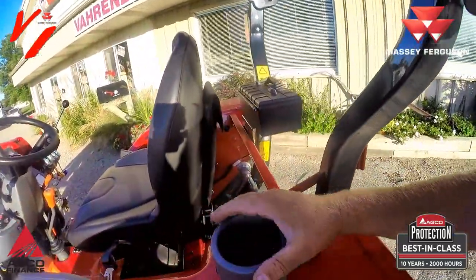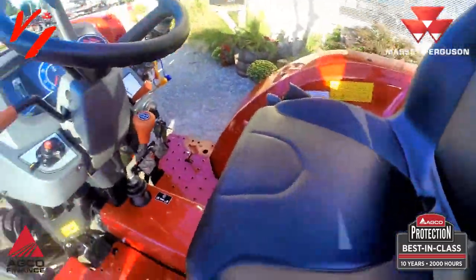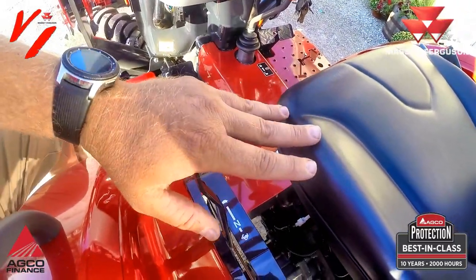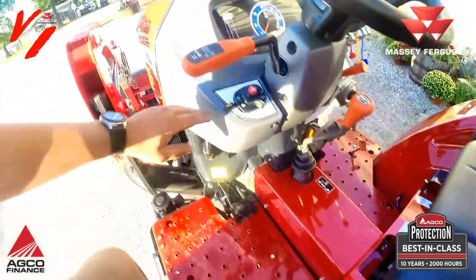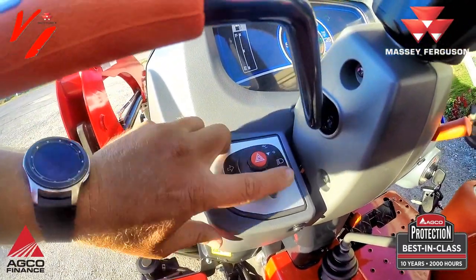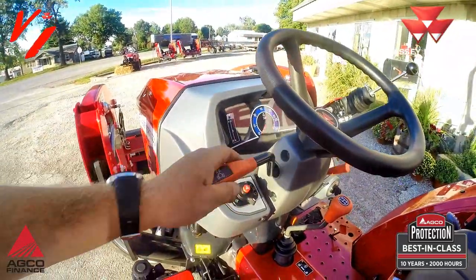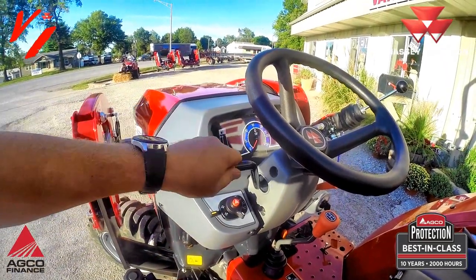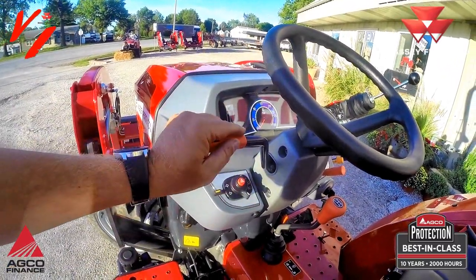One of the most talked-about features is also the cup holder — everybody's got to have a cup. On the left-hand side you have a high range and a low range; you need to come to a complete stop and clutch the pedal before shifting the range. Down here are hazard lights, left and right signals, and high/low beam headlights, then the synchro shuttle lever — you push the clutch and you can shift from forward, neutral, and reverse, and this can be done on the go.